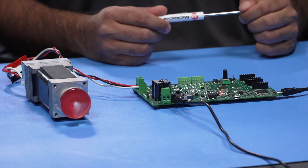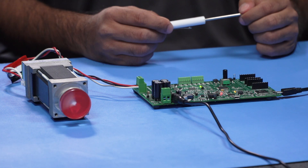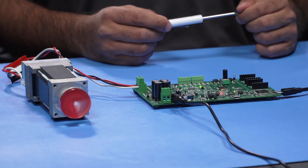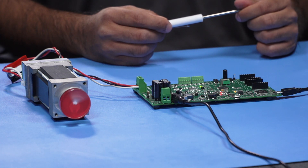It's also a great development board to drive motors rated from 12 to 48 volts. It's also an excellent option to run sensored or sensorless field oriented control for either PMSM or BLDC motors.